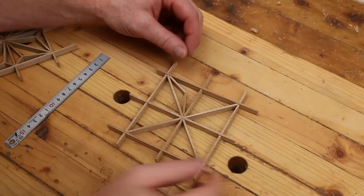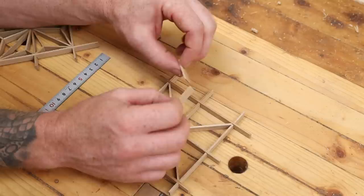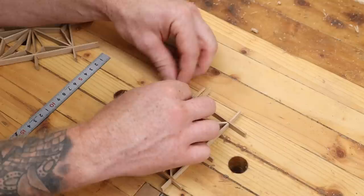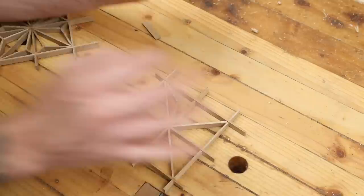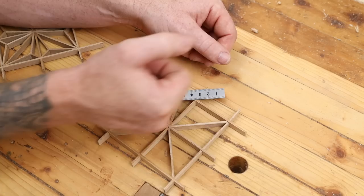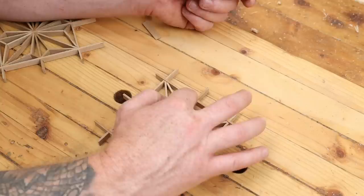When installing these pieces it's nice and simple. The 22.5 degree ends go into the corner, and the two 67.5 degree ends come together — the short sides come together, the side that the point is offset towards. Just slip that piece in, then the second piece, push the two together and they'll almost hold themselves. We then put in the key piece as our final piece. I now have an angle of 90 degrees between these two pieces and 90 degrees here. I check with my steel rule corner to corner — it intersects that angle perfectly, so I know those two pieces are good.